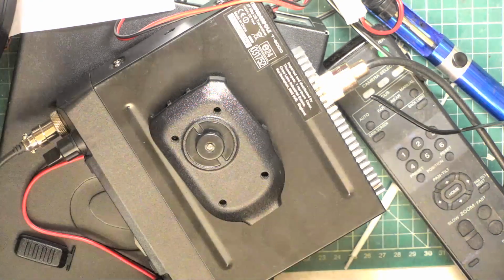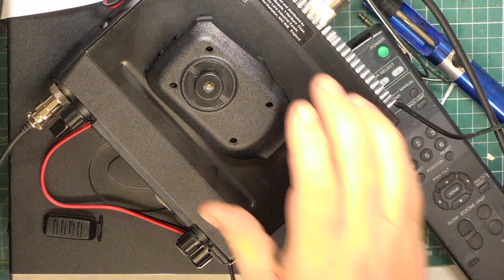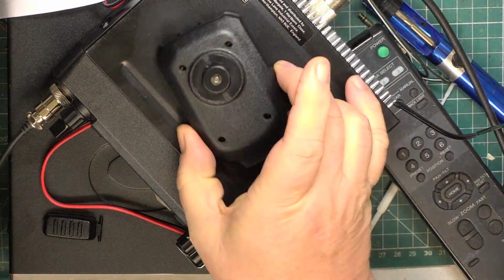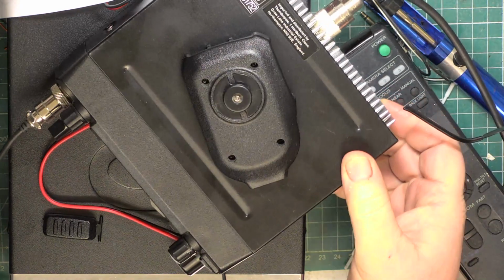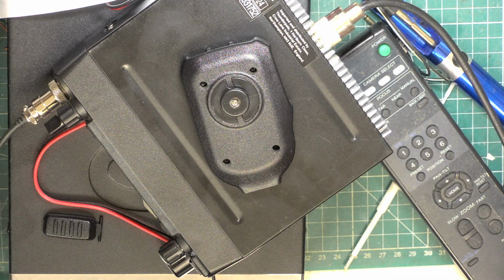Well, I really didn't want to spend another session, to be honest, doing this Thunderpole T2000. So we're revisiting it because one of the complaints in the original letter was it was deemed too quiet. Now, if you remember, when we looked at the deviation, it was 8 kilohertz, so it's like transmitting on 3 channels at once. So it was so loud, you think, oh, is it so loud that it's actually quiet?